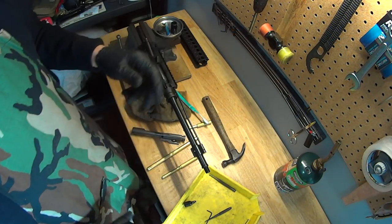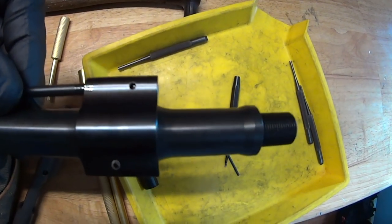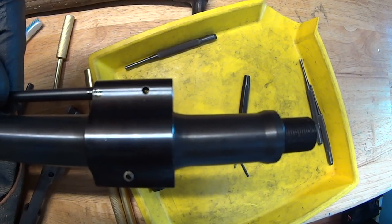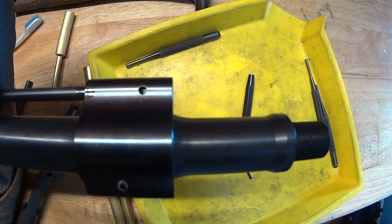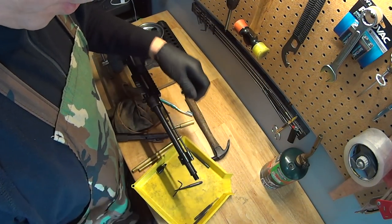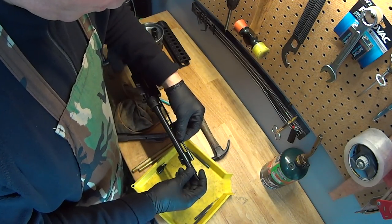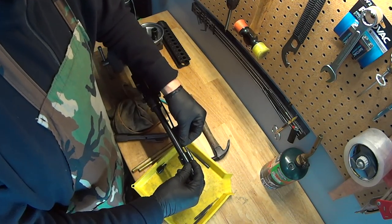Okay, when you're doing this right here, I'm going to take the camera off and hold it up here so you guys can have a good look at it. You have a high contrast surface in the background. Watch through this little hole right here. So you see yellow, and then you see yellow again, about right there. I don't know if that helped you guys see or not, but basically what you're looking for is that little bit of light between. There's the front, I push it back, I bottom out, I realize I now have to back up just a touch.